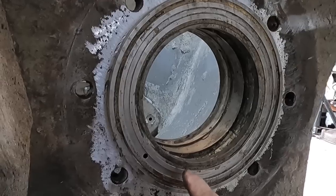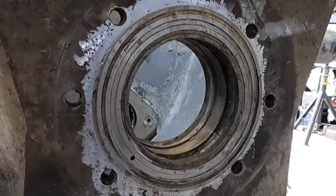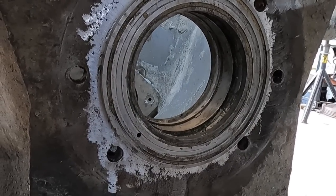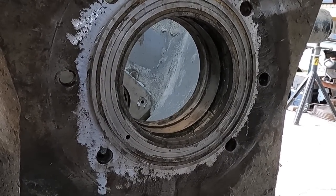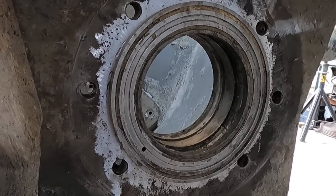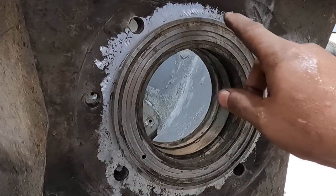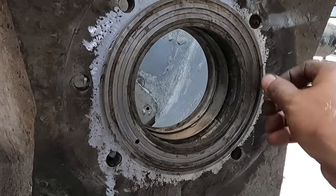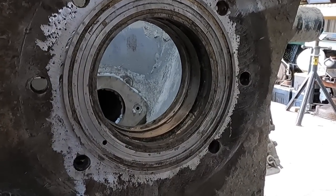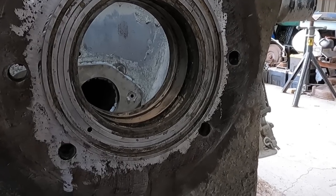And so they normally call me before this is worn out that much. They're talking a really small tolerance as far as before they call, that they say it's too worn out. So that being said, it won't wear through 5/16 of material. So that's good. So now this makes this a replaceable item without worry of wearing into the edge of that bore. Like equipment gets really egg-shaped, this doesn't. So that's the benefit to that. So I think we're in good shape here.